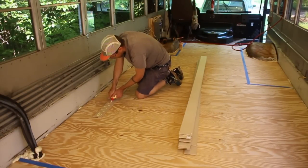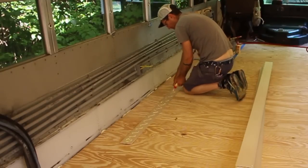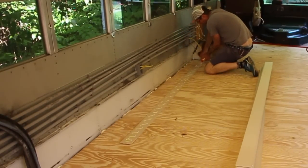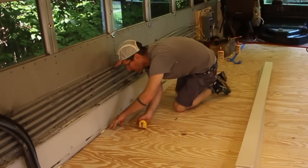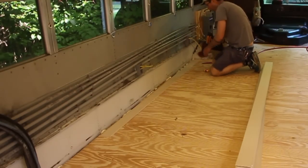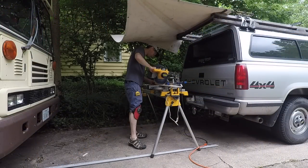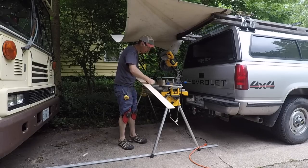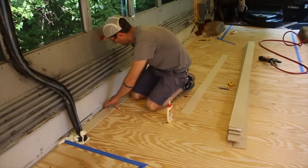My installation steps were to apply wood glue to the board, and then for the first board, I made sure it was perfectly even off the wall. Even just a little bit of unevenness will create a big irregularity over your run. So apply glue to the board, even it up, and then nail it down with a few brads — I used three-quarter-inch brads. Note that you want to maintain an irregular pattern to your boards, so use odd-length pieces to start your rows. Don't let seams match up or even come close to matching up a few boards away.